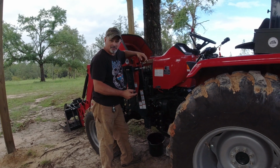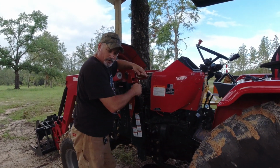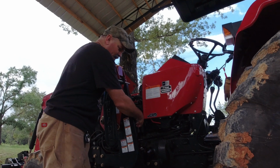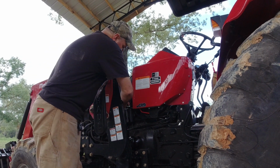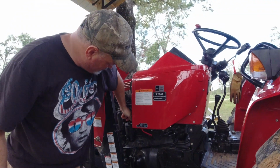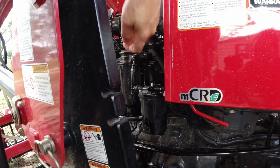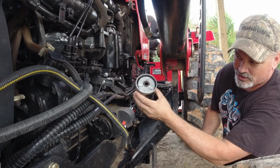So far I've used a 10mm bolt put on underneath it to drain it. Now this fuel filter, I'm going to call this the first one, because it's closer to the driver's seat. This first fuel filter has a 13mm bolt that runs on the top of it. You crank it loose, and then there's a long bolt to it, like so. I'm going to leave it in there, but that's a 13mm one. Here is your first filter.